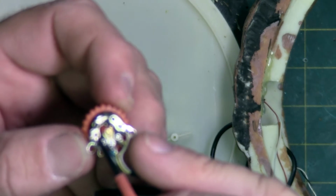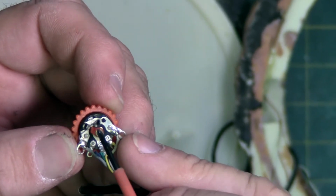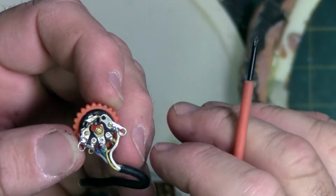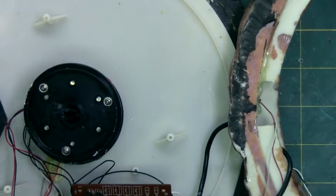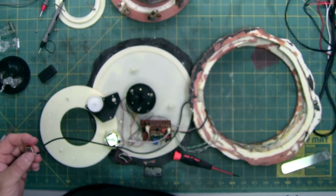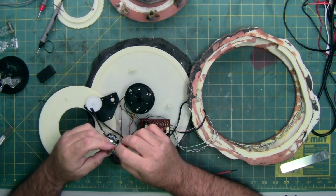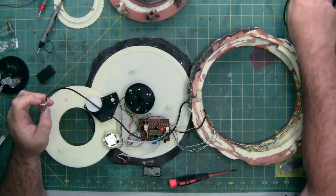Come on. Stay in focus. There you go. If this spring breaks, it's usually garbage. You can attempt to rewind the spring or find another similar spring from a hobby store maybe and fix the switch, because these switches are hard to find unless you can find some donor Lemax pieces. And we'll zoom back out. Wrong way. There we go. So the switch does appear to be functioning. It just doesn't feel as crisp as it should.